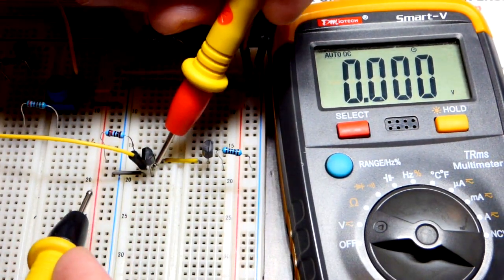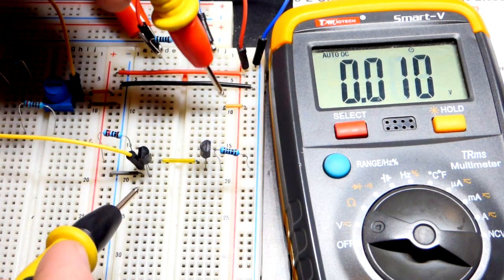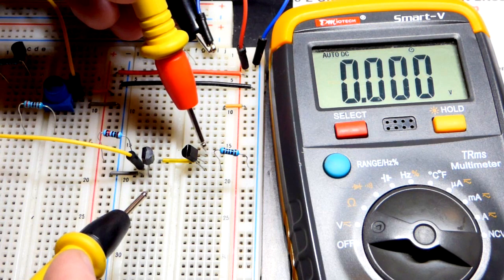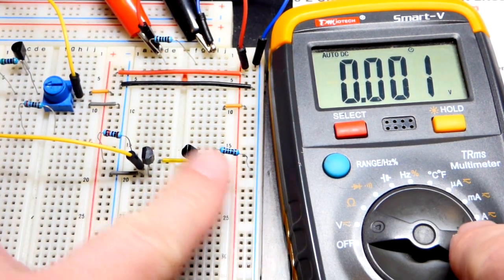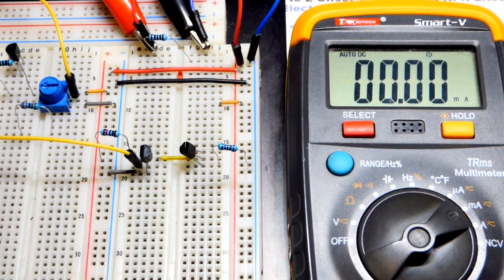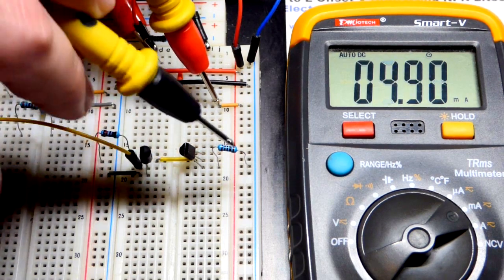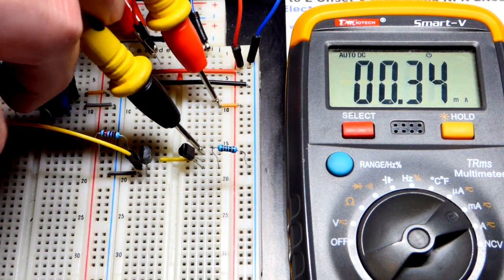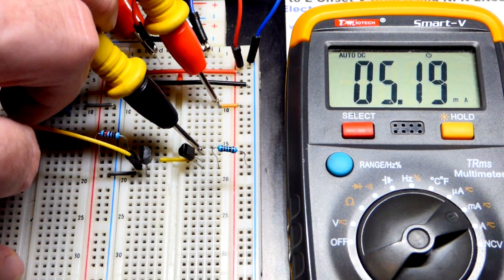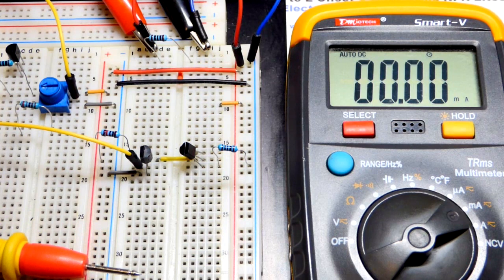The jumper goes to the middle pin of the trim pot. Measuring from there to ground, we get about 5.166 volts. Measuring current from that red jumper to the collector, I expect a little less than 5.2 milliamps — because with a one kilohm resistor, for each volt you get one milliamp. Setting the meter to measure milliamps with no load, the voltage is divided by a thousand ohms, so we get one one-thousandth of the voltage in amps. We gave it five volts, and we're reading 5.19 milliamps.